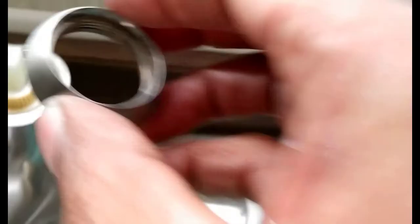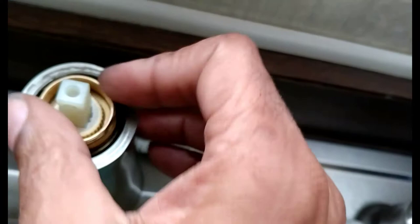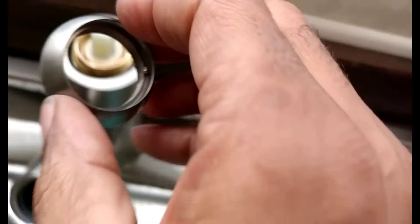There are things down inside of there. Put your valve in — I think there's two little tips at the top. You've got two little tips; put those tips up towards the top and they should drop down into some little grooves in there and you'll feel them lock in. Then you have this little brass ring first, and it's notched on two sides — so you can put a crescent wrench around that and loosen it. But it threads on like so, it screws down. Then this other ring fits on top. So when you take it apart, it's not that complicated. You just want to put some rubber or something around this ring when you take it off, because you can dull it or mar it up.